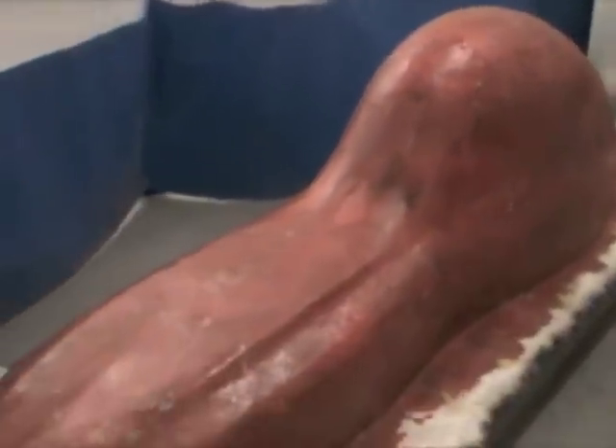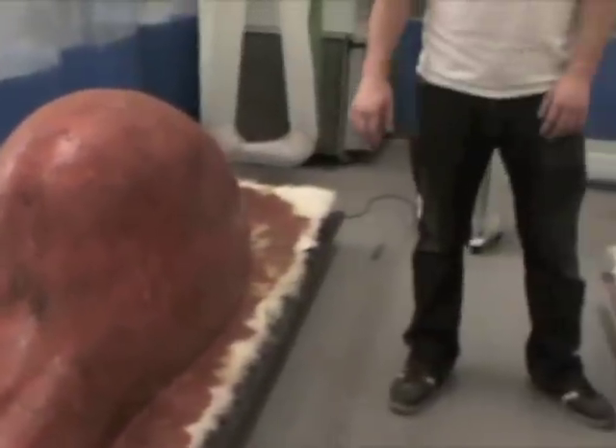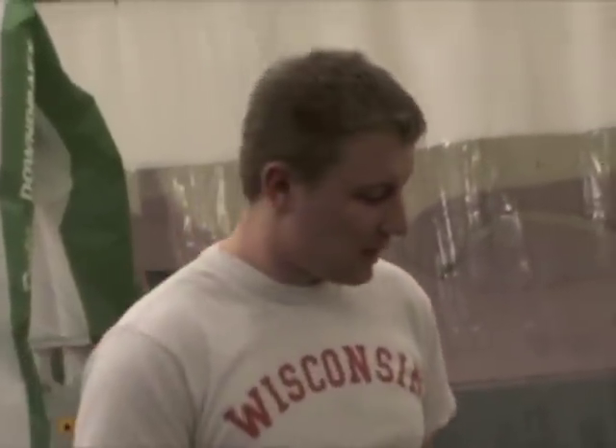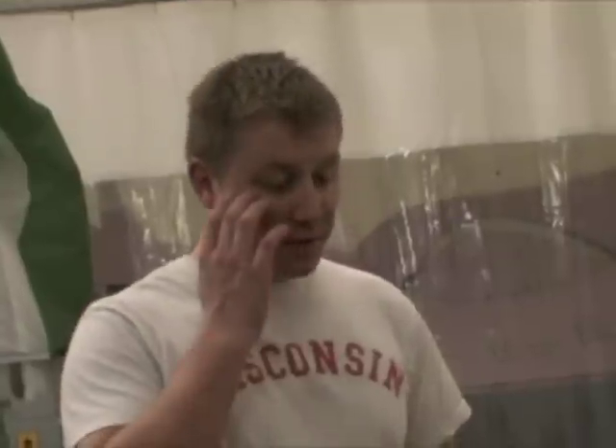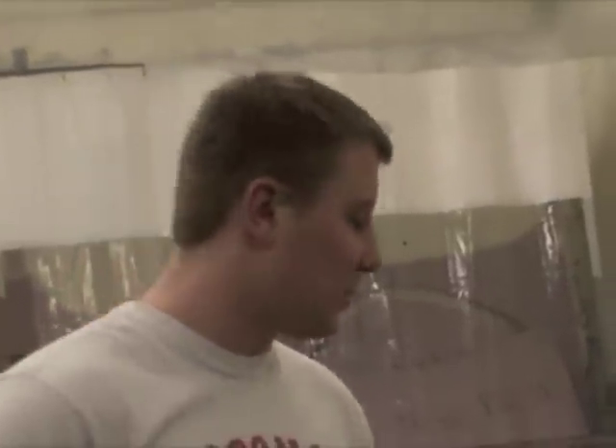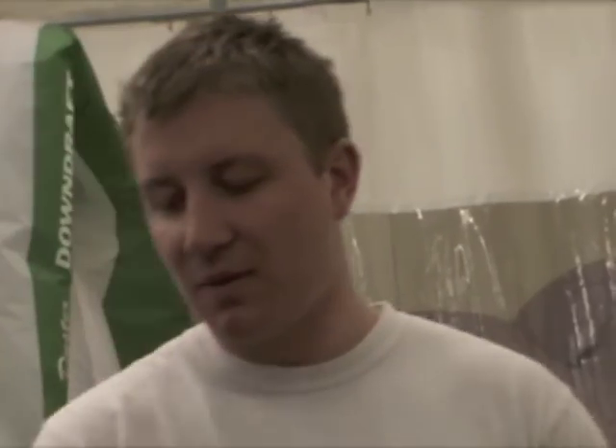The last stages of the PVA were done around 9 to 10 p.m. yesterday, and we were ready to go this morning — we got the fiberglass in at around 9 a.m. We're using a chop mat weave with a polyester resin-based epoxy, hand rolled, so we didn't have any sort of chop gun. In the past we've had tremendous luck with our mold quality, and I'm hoping that transfers here. Overall, there's about 300 man-hours invested into making these molds.